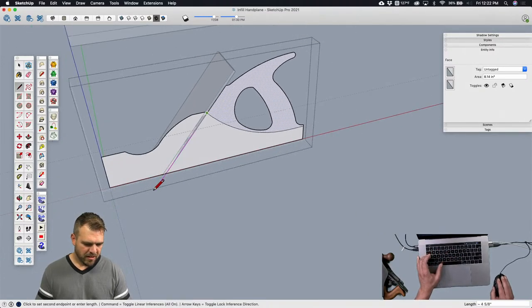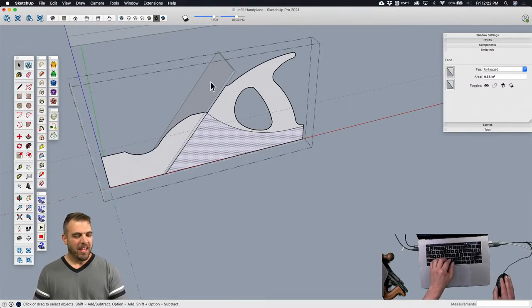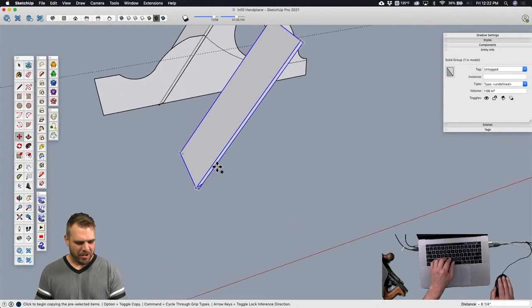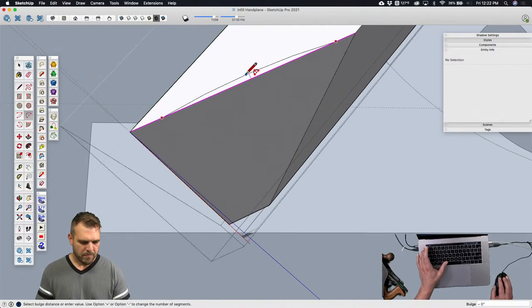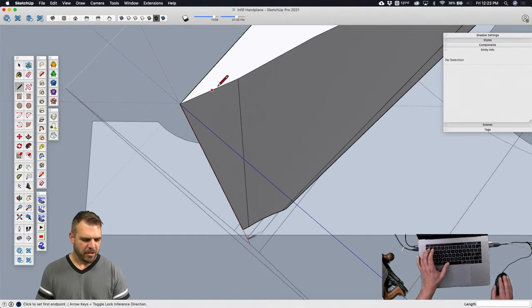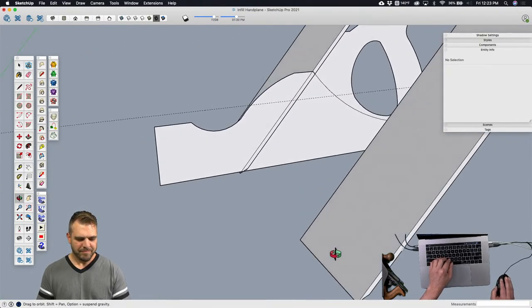You also have a couple people, including Doug, asking for a secondary bevel, 30-degree micro bevel, perhaps. I don't know. I know not what that means. I do, and cut it out. Here, we'll give everybody what they want. Okay. That means we'll even go in here and create a very tiny arc on this, which comes from the grinding wheel. And then, yeah, the micro bevel is just that. It is an extra tiny little thing like that. Okay, now I know what that is. I was missing before, I didn't get it.